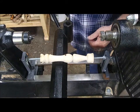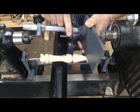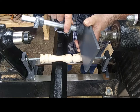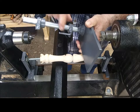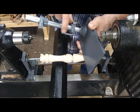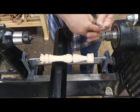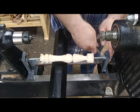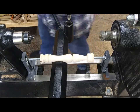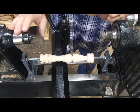You don't have to be super exact because my lathe tool freestyle's tracing element has length to it — it's reasonably perpendicular to the table — so no matter where your spindle ends up on this, you're going to remain a pretty good distance that you had set up for your cutter. Go ahead and clamp this in and tighten these up. I suggest you watch all those other videos; there are some tips and tricks on there.